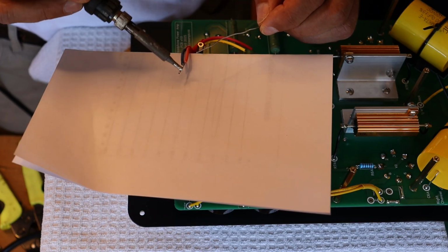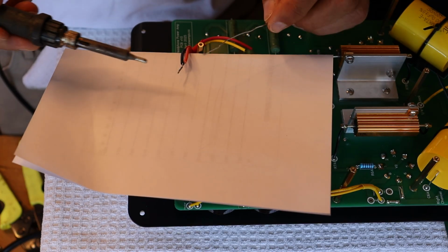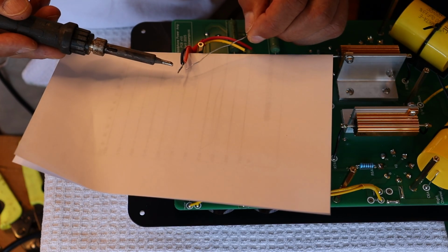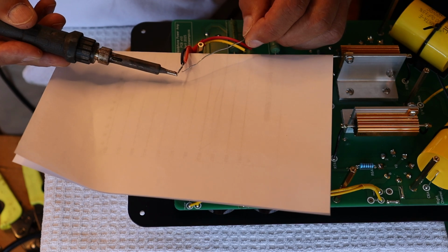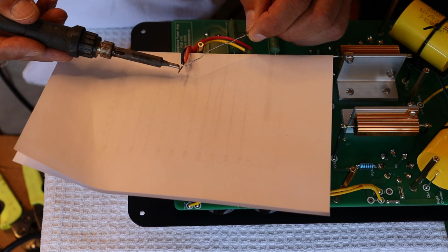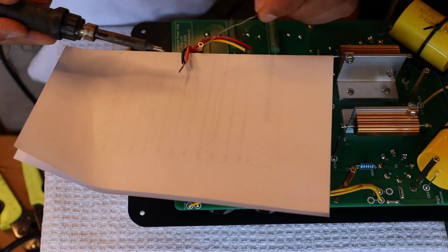So I'm just going very lightly. I think one of the hardest things to understand when you're doing a splice or a tinning, and this is sort of a bit of both, is that you actually want to come in lightly with the heat. So you don't actually want to put a lot of heat fast on here, and in fact you can bring the soldering iron on and off your bundle a little bit to control the temperature.